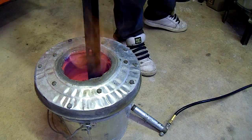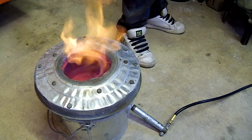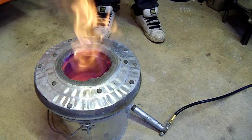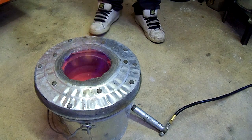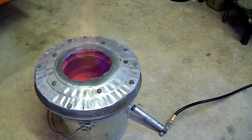If you guys are still watching, don't push soda cans down into molten aluminum, please. It tends to make air pockets bubble up. I've had it happen a couple of times where little pieces of aluminum or burning syrup from the soda come spitting out of the furnace. It's kind of scary, not to mention dangerous.